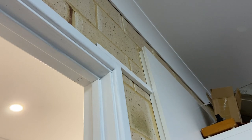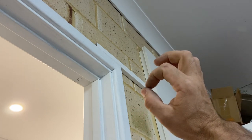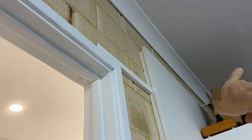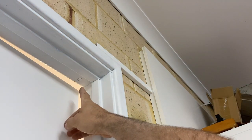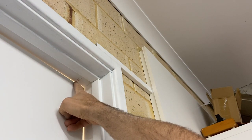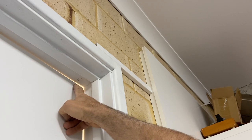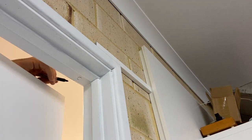Okay, now it's time to move up on top of the cupboard, and we're going to connect our sensor wire, our sensor, into the Quinn LED board. And actually, first we'll drill a hole in the top of that door just there, just up here to line up with that reed switch just there. It's got quite good range, but we want to get it as close as possible. And then we can connect up the Quinn LED board up there.